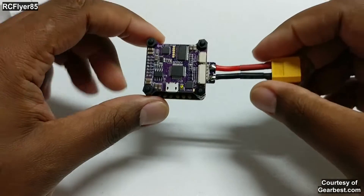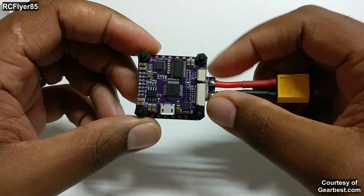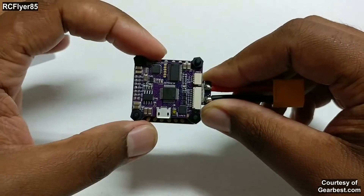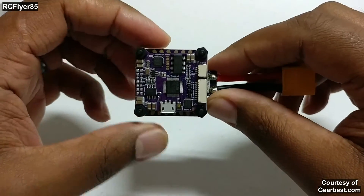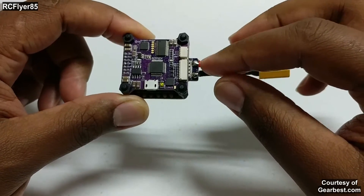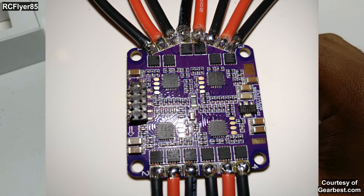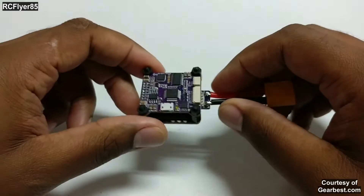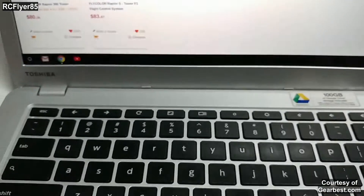The new board comes in the same packaging with the same set of wires. The new board has a new design which I actually really like — some people aren't liking the new layout, but I do. The top board is a little smaller; they cut that away to save some weight. They moved the ESC pads to the sides in an X configuration, and they moved the power leads to their own little tab in the back. If you remember the original, I'll put a picture on screen — soldering was really tight. With this new layout there's a lot more space between the pads, making it much easier to solder.